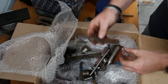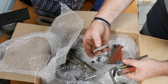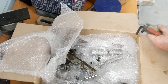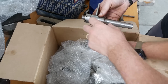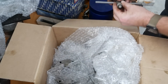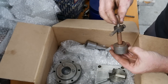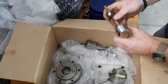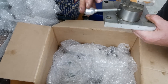A nice little brazed carbide parting tool. Dead center. Nice bit of carbide tooling. Bit of high speed steel. It also looks like he's looked after his tools because most of these look like they're not chipped or anything. A nice sliding die holder - I made one for my mini lathe but the sticking out shaft was too short so it's useless, I need to make another. That's a tool height setter - to adjust your tool height. Very nice little shop made tool. Here's a circle turning attachment - that's damn handy.